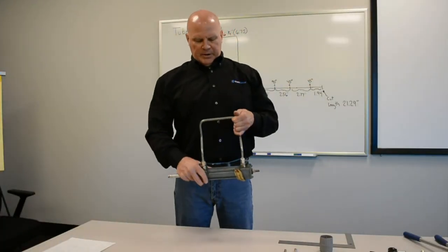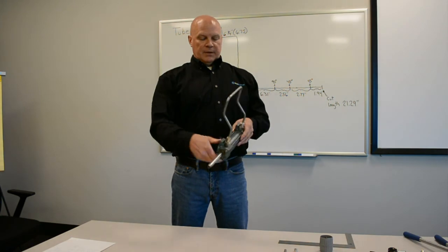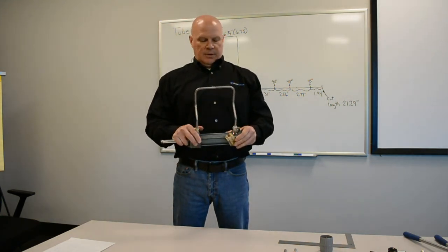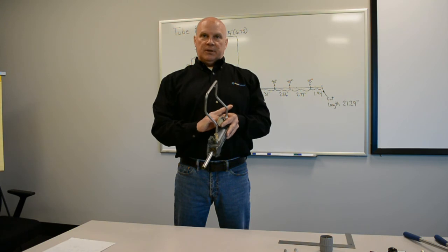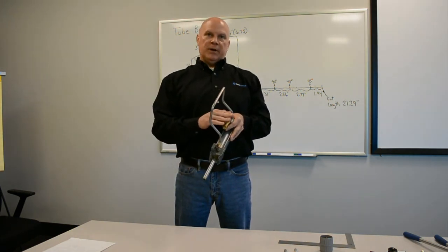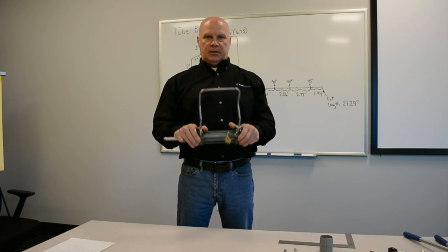Okay, now that we've completed our assembly, you know how to do 45s and 90s for a kickout like this. So in the future, just reference your job performance study guides and manufacturer specifications for the proper lengths the legs have to be for the different angles, and how much bend, depending on the bender, that's why I'm saying manufacturer specifications, that you're going to have to account for in making this assembly and making it fit.